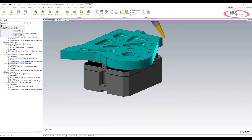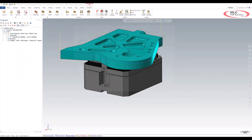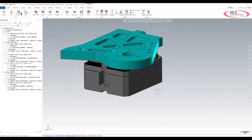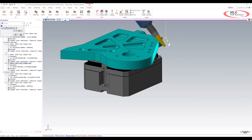If I click here, we can see the flutes and how this reads in percent. At 50%, we're at the center of the flute length for this tapered end mill. If I wanted to run at, say, 10%, I can now change the contact point at which this tapered end mill will follow my part. At 10%, you can see the contact is more so at the front of the tool.